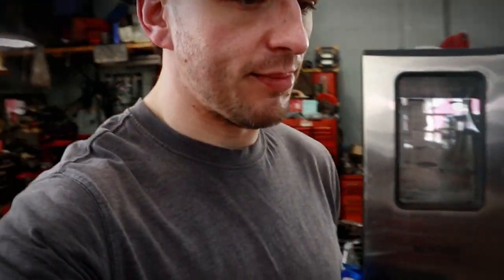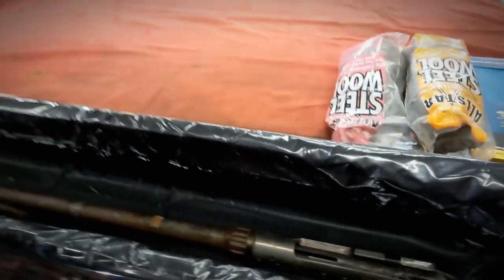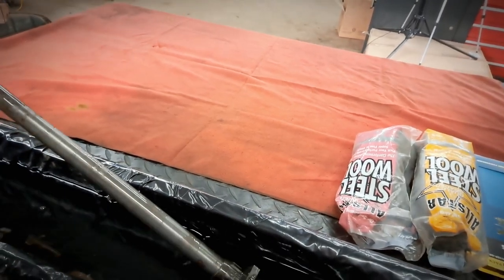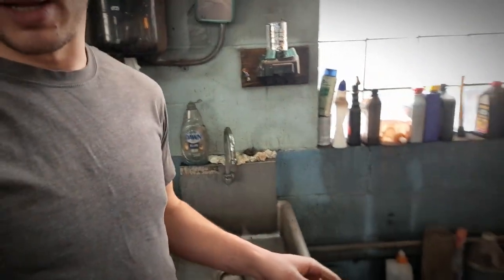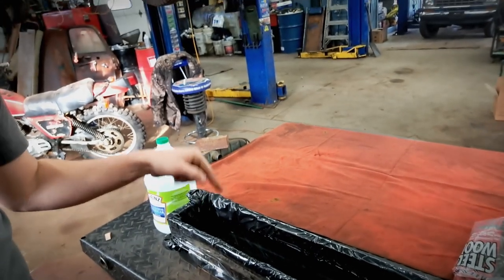If you're going to use the vinegar trick, it'll wipe it all away — there's just nothing left, it's down to bare steel, which is perfect. Because it's an acid, you're going to want to do a really good rinse in water before you start sanding, otherwise it's just going to rust on you. So take the action and all your parts out, run them to a sink or bucket of water, and just rinse the hell out of it.